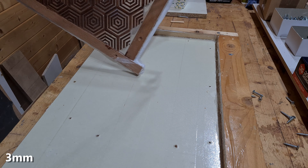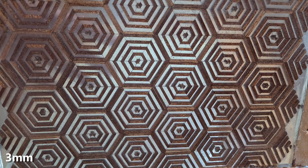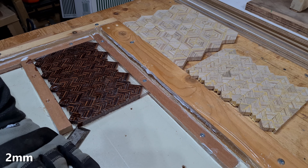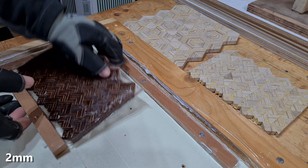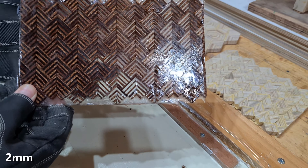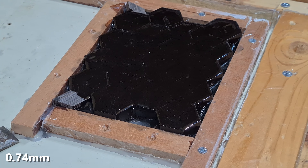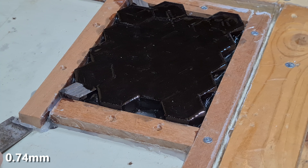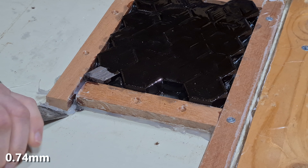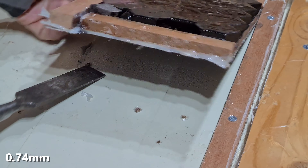Hopefully you'll be looking at the light transmitted through the ply rather than at the alignment of the pattern. I think the two millimeter alpine mountaintops look really good — everything was neat and this was perhaps the easiest pattern to reproduce. On the contentious issue: plywood by definition is the layering of wood veneers glued together cross-grained. I didn't cross-grain the wood, but it can be done, and the definition doesn't specify what adhesive to use or how thick it can be applied. I spaced each wooden strip by its thickness to get a uniform alternating sequence of wood and resin, hence being transparent in two dimensions. If you disagree, write it down in the comments below.